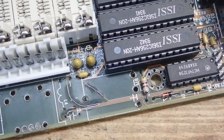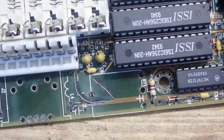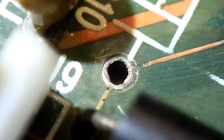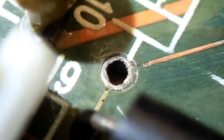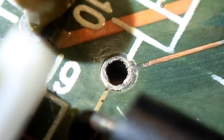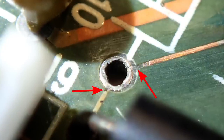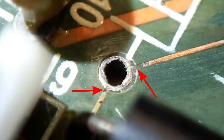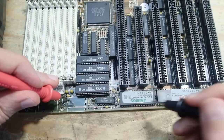The damage on this board turned out to be bigger than expected. A lot of micro cracks in the traces, and especially defects like this one, were very annoying. You usually try to measure the continuity from one joint to another, and then you waste a lot of time tracing the connections, not understanding why there is no contact, and then realize under a magnifying glass that a trace ends shortly before the solder joint on both sides. Well, but after a while I had all broken traces fixed and the keyboard was again connected to the controller.